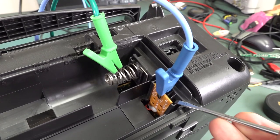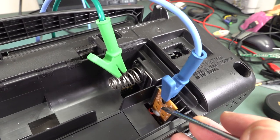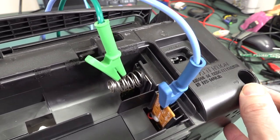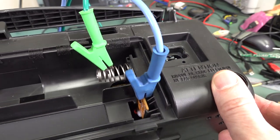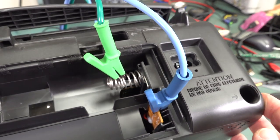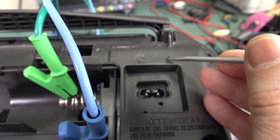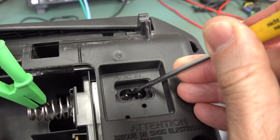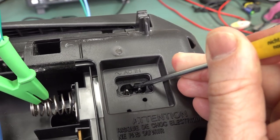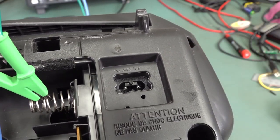The first thing you would do is actually try this on battery power as well, to see if it's anything to do with the mains power supply. Power it from the bench power supply. I like how they use the board down there for the final contact — just a couple of jumper links on there for the positive terminal. I was wondering how they switch between the DC source and the AC. They could just diode it, but often they'll have a DC-AC switch. I looked in here and saw this — I reckon that is a little micro switch that automatically disconnects the batteries when you plug in the AC power cord. Isn't that neat?